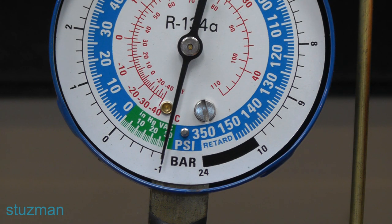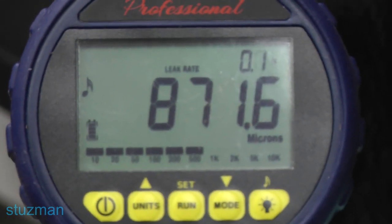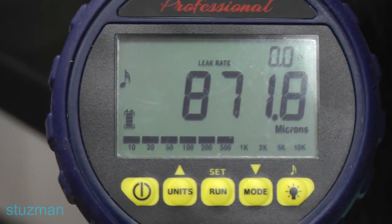It's been about 41 minutes now, and I cannot tell that this compound gauge has moved any lower — it looks about the same for the last 35 minutes. The thing is, this gauge is marked in inches of vacuum, and even the pointer itself is about the width of one inch. So we really don't have the resolution or the accuracy to see these very small changes in pressure when we're taking the air out. But let's take a look at the micron gauge — we have 871 microns. We still haven't reached our minimum of 500 microns.